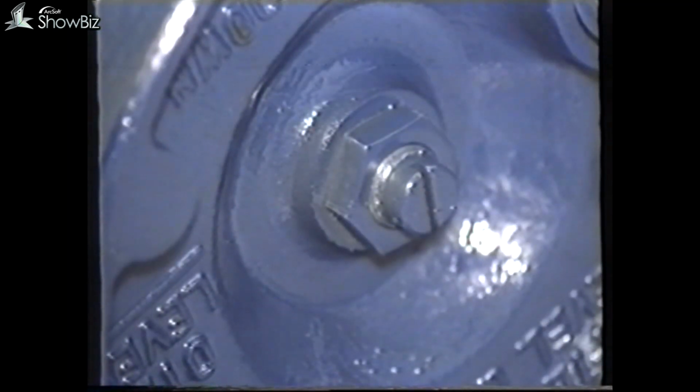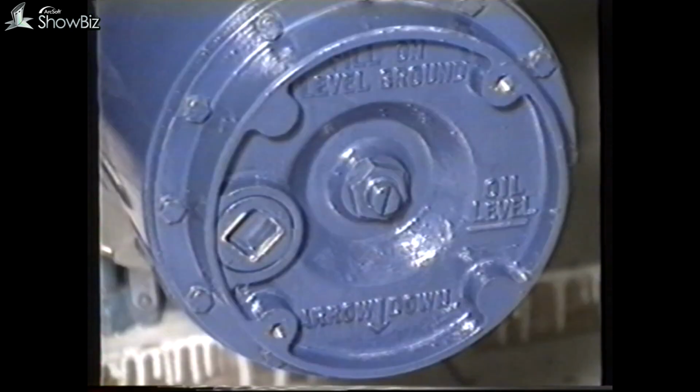To adjust the axle shaft end float, release the lock nut, turn the screw in until contact is made with the end of the axle shaft, and release 1/3 to half a turn. Retighten the lock nut, and finally top up the hub with oil as before.